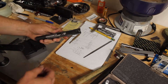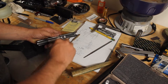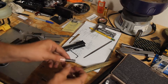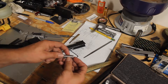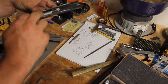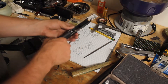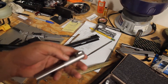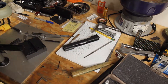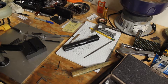Back at the bench, now that we're done with the lug cutter, go ahead and put it away. Here you can better see the pointed end pointing up into the barrel — it does leave a tiny little mark on the bottom of your barrel, but it's on the inside and underneath, so don't worry about it. The gun looks pretty clean, definitely satisfied with that. Next we need to put the link back in and test the fit again.